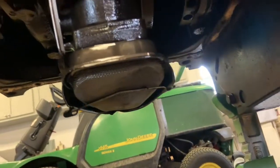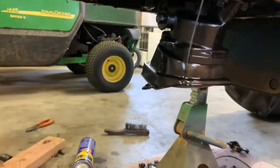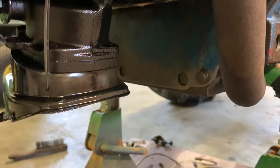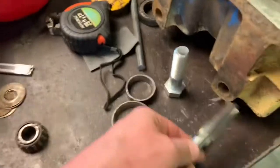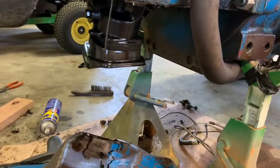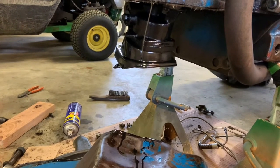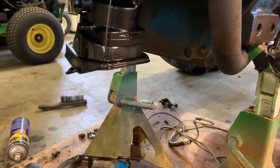I'm probably going to drop that oil pump off of there so I can figure out what I'm going to do with drilling that bell housing. It appears to be — I measured it — three-quarter, sixteen. I do have a three-quarter sixteen tap. My biggest concern when I drill the pilot hole is to get it straight. What I'm thinking is maybe make some sort of bushing with a hole in it that I make on the mill or lathe, so it's centered. Then I can either bolt it to that little bolt next to it and use it as a jig to make sure I get a straight hole.